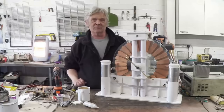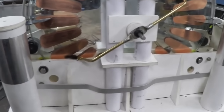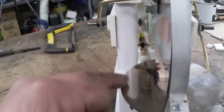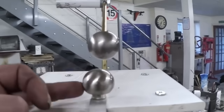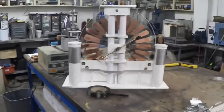The only things left to do are join the current collectors up to the capacitors and put something on here so we can get the sparks to spark across. We also need to put the brushes in the neutralizer bars. The brushes are actually carbon fibre tow — you buy it on a roll, unravel carbon fibre cloth, and they make great brushes. Remember to burn the resin off them first. Here is our capacitor connected to our aluminium disc with the jagged teeth, connected via a bar to the inside of the pipe capacitor and also up to where we're going to get the sparks, with one movable ball and one fixed ball.